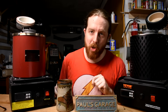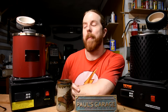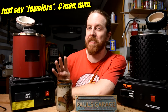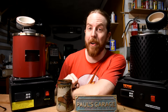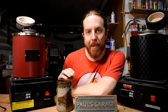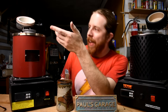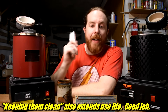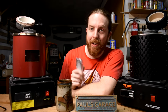Fourth, keep track of how many times a crucible has been used. If it starts looking real bad, don't use it again. I've heard from people who do gold casting, which is super high temperature — they're only getting like four or five melts before they start getting nervous. Bronze is cheap, at least compared to gold. I suspect if you're melting ZA-12, you probably have a lot more melts in it. Do one crucible full of molten bronze and you can tell the crucible looks different. I've done multiple ZA-12 melts in one crucible and it still looks pretty new. Bronze is much hotter — 500 is not 1,100 Celsius. That's a big difference.